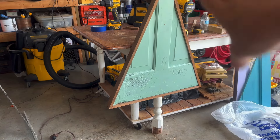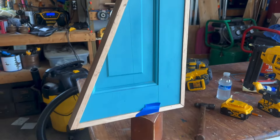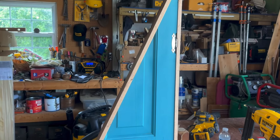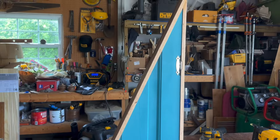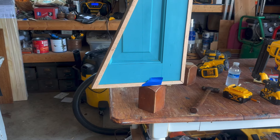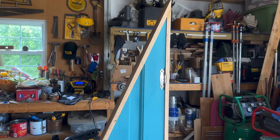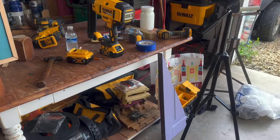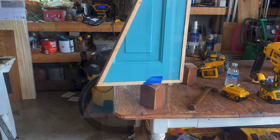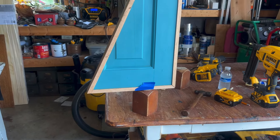The best thing to do right now is let that glue dry — it'll drip down into the dowel, and after it's dry it should be nice and stable. I'll move on to the other ones and get the trim work done, then come back to this one. I'm now at the point of adding the feet to the second door tree. Because this tree is offset, the trunk isn't going to be in the middle — I just moved it on the table until it was steady, then marked it, drilled the dowel hole, and attached it.